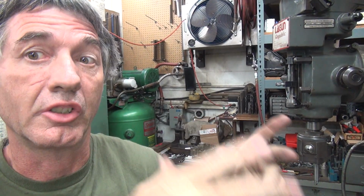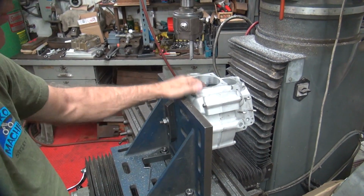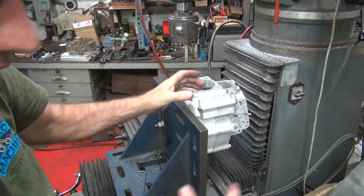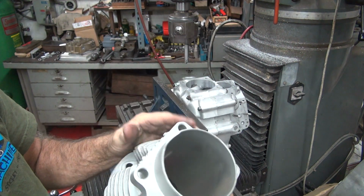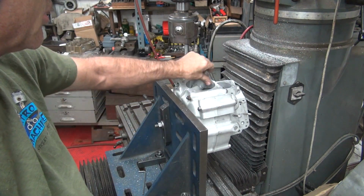If you're doing a really, really close fit, you run 3 to 5 thou clearance. When you get down to 3, the cylinders don't want to go down. When you're at 5 to 10 thou clearance, they usually slip down pretty good. So we're in the 8 to 11, 8 to 12, somewhere in the area right now, so got a little extra clearance, but good. But like I said, I don't know what his cylinders are, I don't know if they're aftermarket, they cut different, you don't know. So too tight, you can't use, a little bit loose, ain't going to really hurt you.